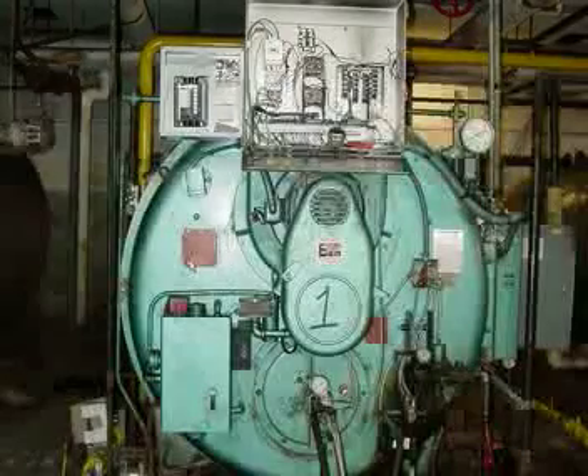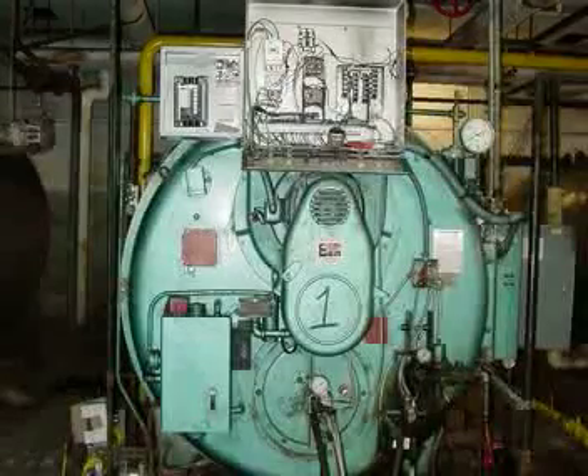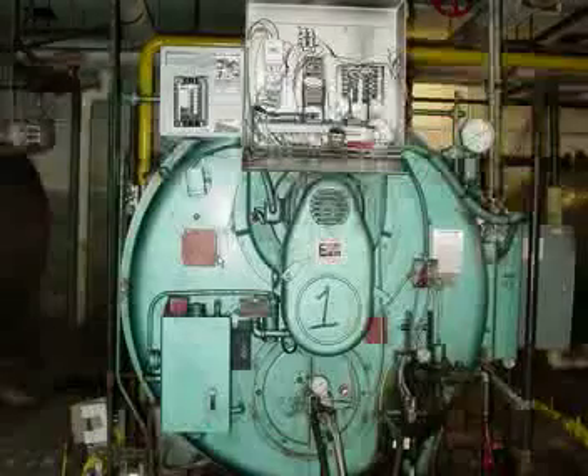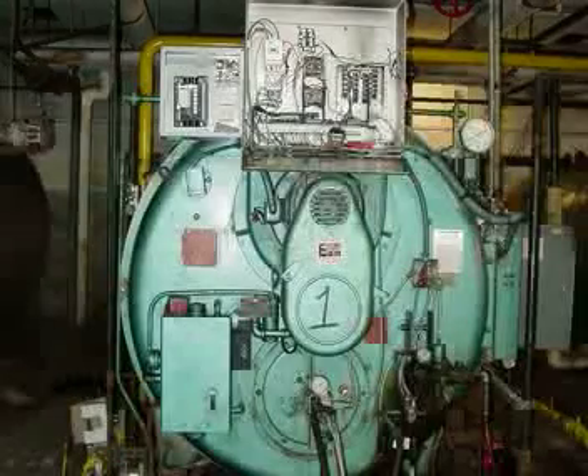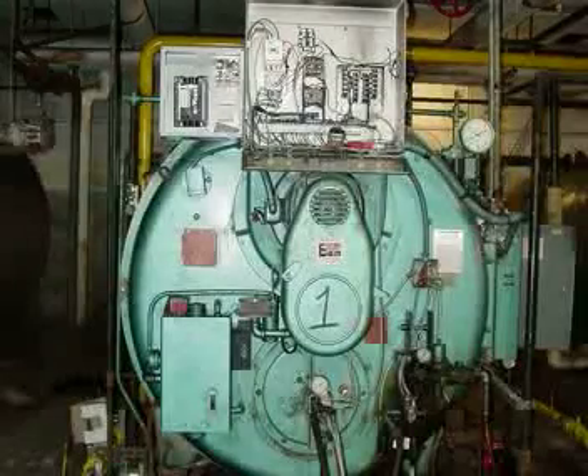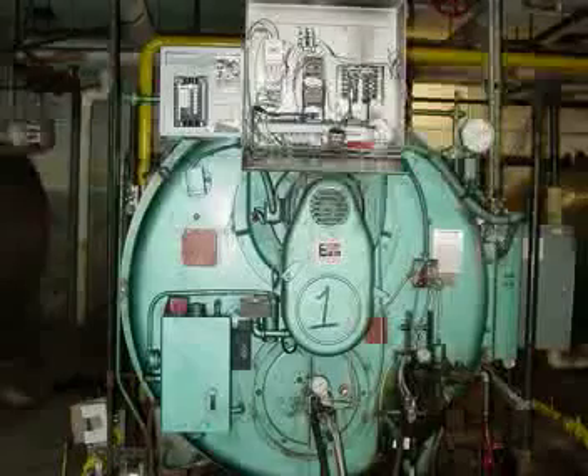Now here's where some work is getting done. The foot-mounted actuator is now gone. If you notice, all the linkage is gone. We started to mount the kicker box on the side of the main panel with the sub-base for the Honeywell Controls controller.